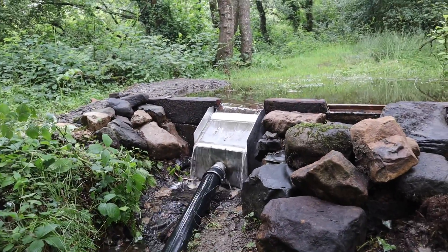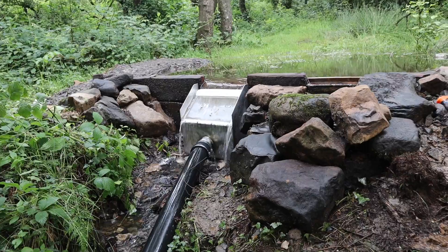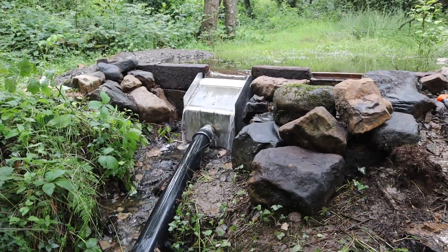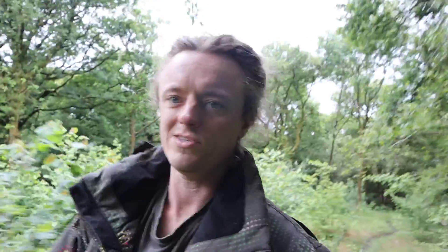The intake's doing great — I haven't cleaned it at all. The back pressure and stuff has been clearing it. It's been running — it never before would run at full power for this long without me needing to clean it. So it's working very well. The system has been bleeding for a while now, so hopefully all the air's out. I'm going to walk up and have a look. Can't run a full power test — the rain's died down. This time of year the stream drops very quickly after rain, unlike winter. So we're not going to be able to do a full power test running at 400 watts — that's one nozzle off, running at three-quarters. We'll see if any air is getting in; I suspect it probably is, but only right near the intake.